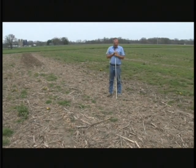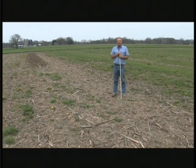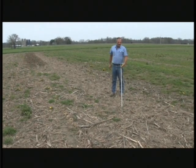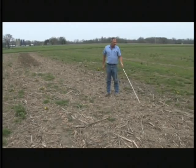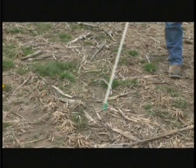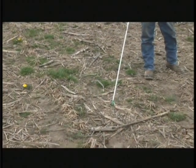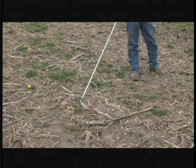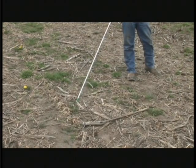In order for the imprints to work properly, there must be some small type of tillage in front of the imprint wheel so that we can make a print — it doesn't have to be aggressive tillage by any means. Certainly an example is exactly where I am standing. We imprinted this area right here, and I want to immediately point out that where we had minor soil agitation on the surface, where we didn't do this, you can look here and see the corn residue. This would be hindering residue for early spring planting.